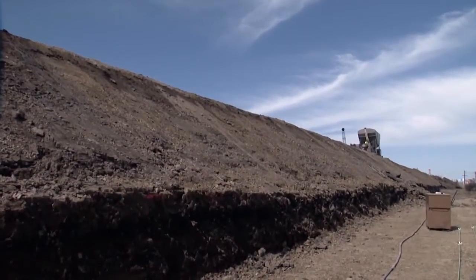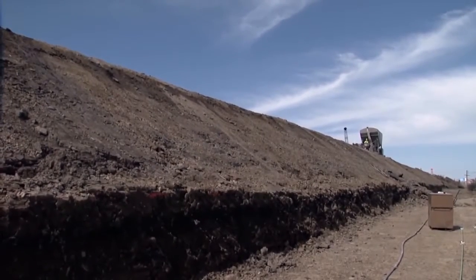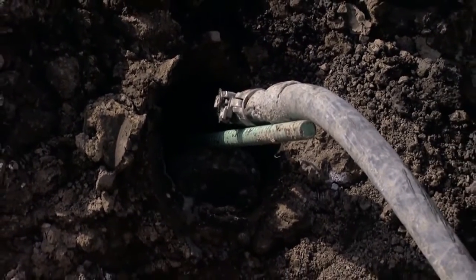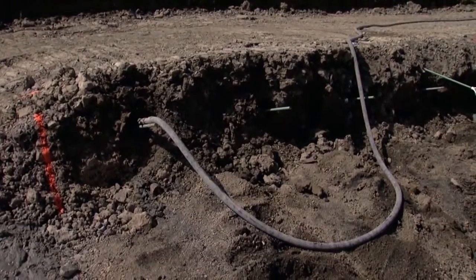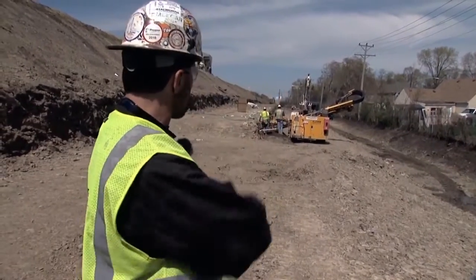This wall tapers down into nothing to where we're standing, but as they progress, this cut will get deeper and deeper. We will then place wire mesh and rebar and reinforce that whole area, and then we will pneumatically place concrete — we will just spray a concrete wall. It's four inches thick. And together, the soil nails and the bearing plates and nuts basically sandwiching in all of the wire mesh and the rebar and the concrete will perform the earth retention needed for that MSE wall.